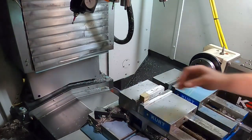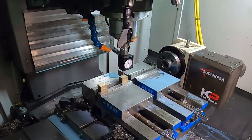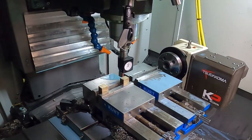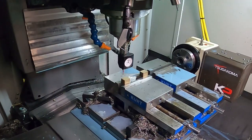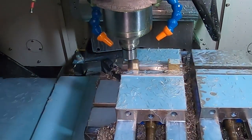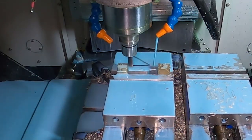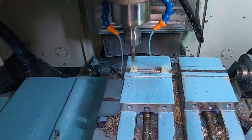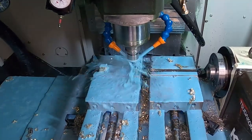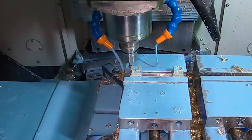Now to make the main rod bearings. I had a piece of 954 aluminum bronze that was the perfect size so that's what I'll be using. I'm placing material for both bearings in the vise and we'll set up two separate work offsets. I'll use the indicator to locate two independent zeros and input them to the mill's G54 and G55 locations. This way I can have Fusion 360 repeat all operations at these two offsets and I won't have to think about how far apart these two pieces are from each other. The half inch end mill will face the blocks and remove the bulk of the outside material. This 9/16ths drill will rough out the bearing hole and leave some room for finishing - the final dimension of the bore will be 5/8ths. To make the slot perfectly centered with the bearing hole I'm using a key cutter to profile the middle. Key cutters are almost never the diameter they say they are so it's critical to measure them as carefully as possible.